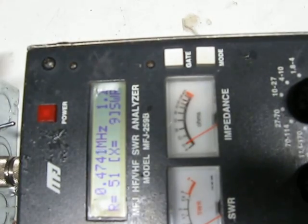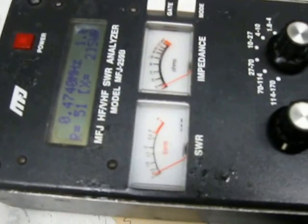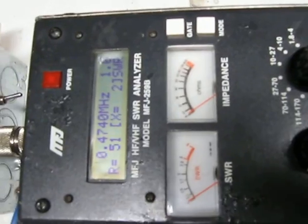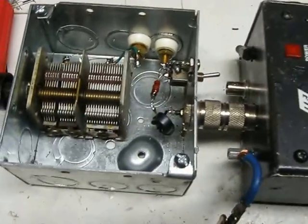I could probably get that reactance better — see, I can get that reactance down to 2 ohms, and it doesn't change. So Q = 2πFL over R, which is 1 ohm — the difference between 50 and 51. So I've got a Q of over 400 on this thing.